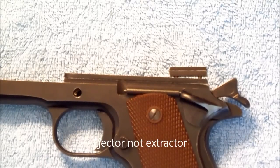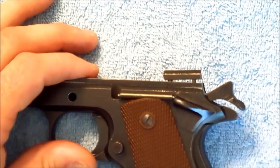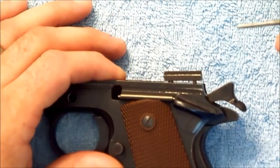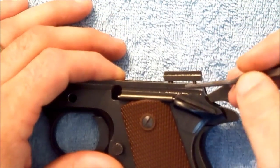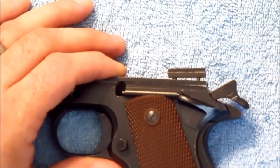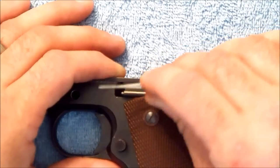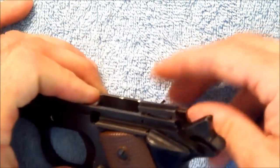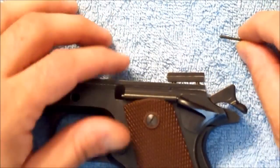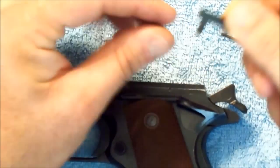What we found with that was that it's loose. What I'm going to do to kind of try to recreate the portion of the video that I had to cut out — if you can see, there's a small pin right here in the rail. That's a 1/16th inch pin. I can just probably push it out with a paper clip because it wasn't pinned in place. It's just a typical 1/16th inch roll pin, and that's what holds the ejector in place.